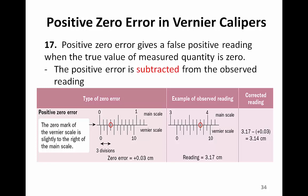It may seem confusing, but it is easy to remember. When there is a positive zero error, it is as if the Vernier calipers' jaws are open — but they are not, because we say it has a zero error when both jaws are closed, yet it gives a non-zero reading. Therefore it has a zero error, and this zero error is a positive zero error. In this example, it has a positive 0.03 cm. The observed reading is 3.17 cm. Therefore, the corrected reading is 3.17 cm minus 0.03 cm, which gives 3.14 cm.